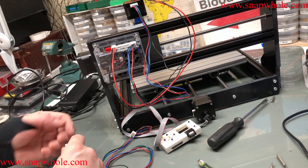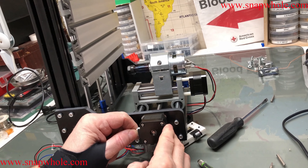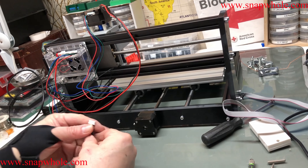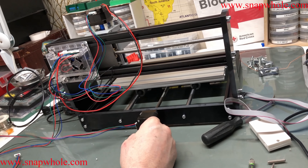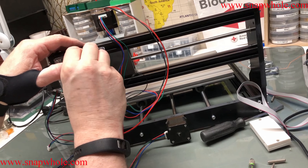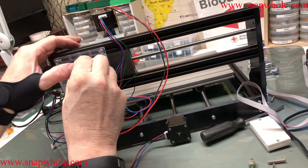On the X, if you remember, put the stepper motor cable down — the tabs go to the front of the motor, so I'll just plug that in. The last one: the 5-pin tabs go to the top of the motor. The X comes over and gets plugged, amazingly enough, into the X motor slot — tabs go up.